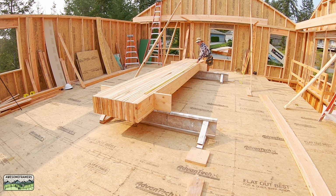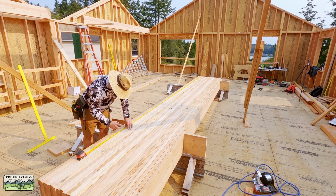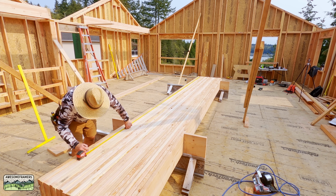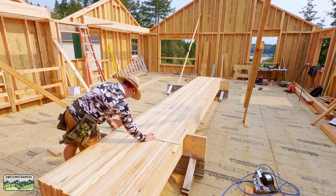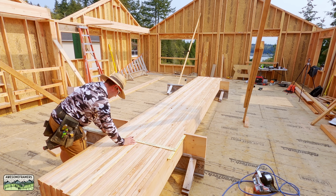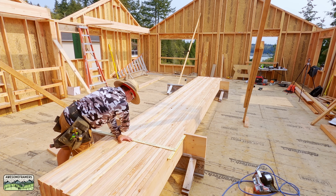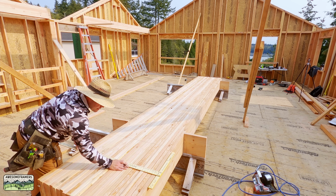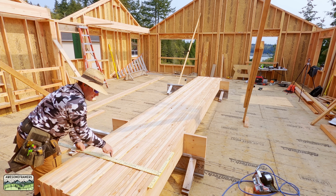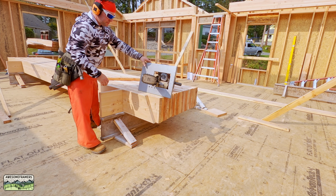I typically take my first rafter and cut it, lay it down in the racks, and then stack the rest of them. So what I'm doing here is transferring all of those marks to the opposite side, and then I'm going to either snap lines or use my T-square to connect all of those dots. What each of these lines will represent would be the heel of the seat cut, the plumb portion of the bird's mouth, and also the plumb portion of the tail if you choose to cut the tails, which I did in this case, partly because we already had all of our soffits pre-attached to our overhangs. You can find the video on my channel where we pre-install all of our soffits before we lift the walls. Saves us a lot of ladder work.